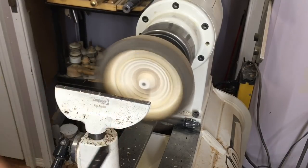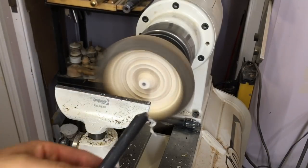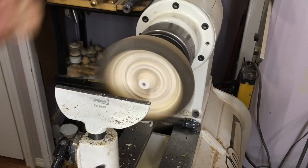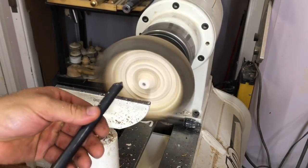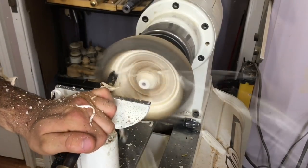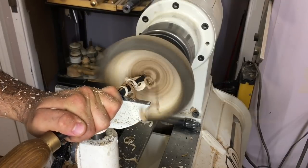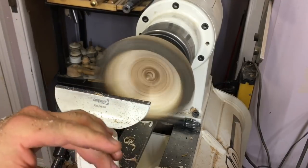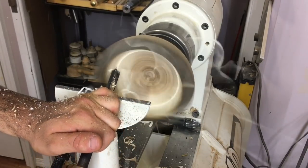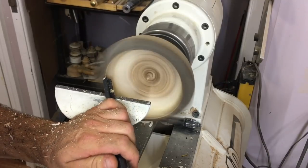Now I'm going to do the same again — push the other way. Watch that wing over there though; if you approach the wall and hit that wing you're going to get a heck of a catch. One thing I forgot to do is relieve the heel of the tool, so before I sharpen next time, before I do the inside of the wall, I'm going to relieve that heel so we don't leave a big burnishing mark. The tannins in this butternut — even though butternut is fairly soft — dull the tool quite quickly, so I'll take a couple more passes to approach final wall thickness and then sharpen up before hitting that final touch.